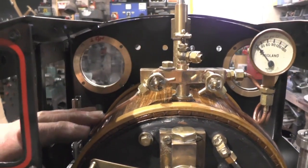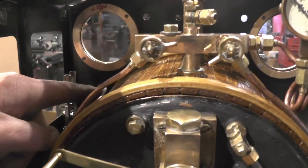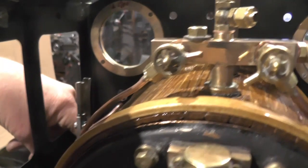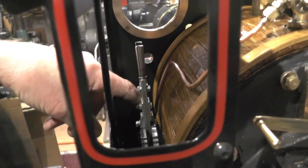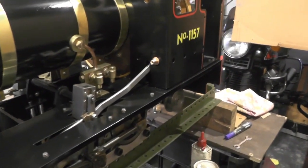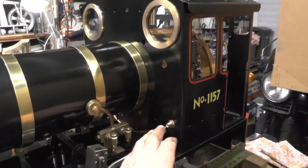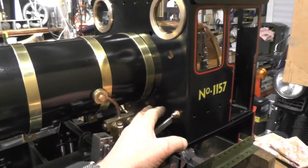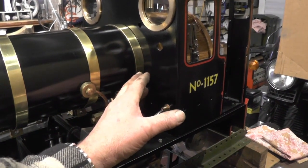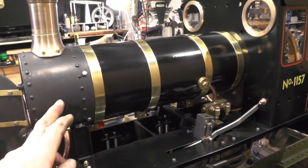I've got the part where it's connected now to the valve, and that's going round there down to that union. The union is coming out at the bottom of the cab. What I've got to do now is make another piece of pipe using exactly the same procedure, to go across towards the boiler up to the centre line and then across to the smoke box for the elbow.